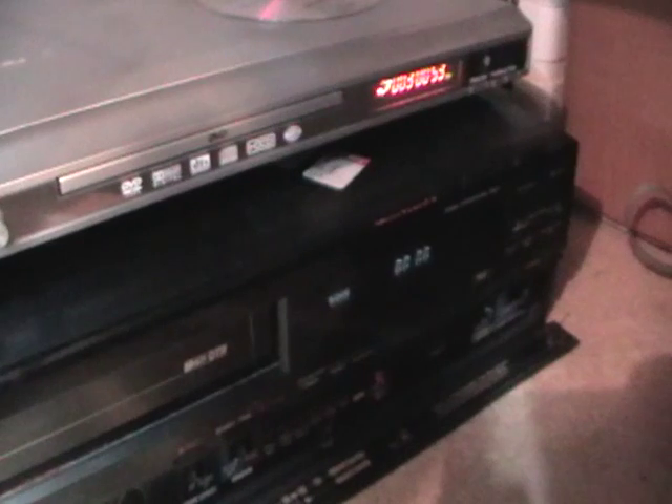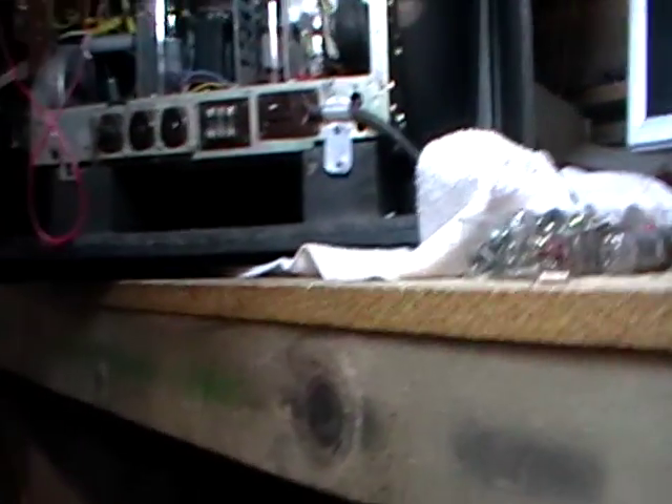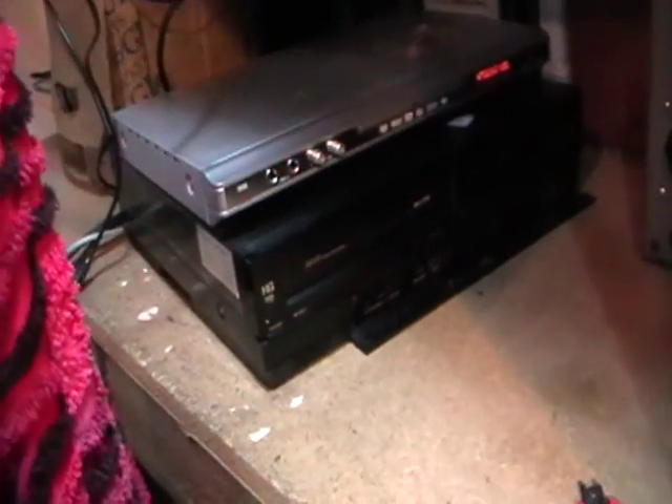How I run all my old TVs: I've got an old Mitsubishi HS411 VCR down here - a Hi-Fi model. The beauty with these is they seem to ignore Macrovision, so you don't get that Macrovision effect affecting the picture. I've got a cheap Dick Smith DVD player running via the AVs and my test pattern DVD. This is pretty much how I'm going to have to run my vintage TVs until I get a set-top box sorted.